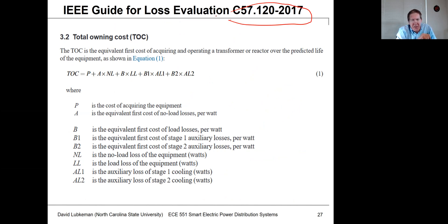When considering a transformer design, you look at total cost of ownership — not just acquisition cost, but also the ongoing cost of losses once the transformer is in service. It doesn't always pay to get the cheapest transformer or to minimize purchase price alone. You must consider no-load losses: cheap transformers that consume a lot of power due to core losses will hurt you in the long run.